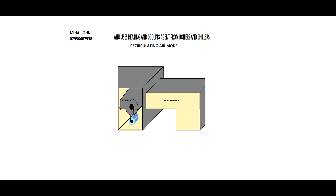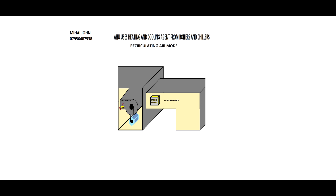Once you finish this, you have to install a very important safety feature — the smoke alarm. The smoke alarm has a probe which senses if there is any smoke in the store, and will stop and start some functions. Like the supply fan, the extractor fan also needs a differential pressure switch that will tell the BMS the status of the fan.